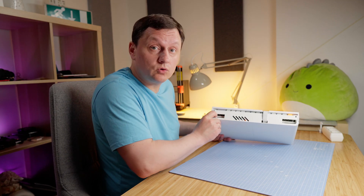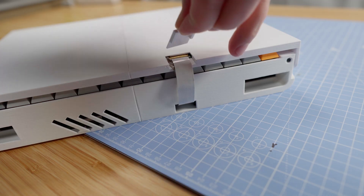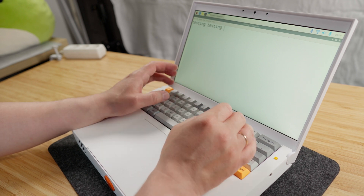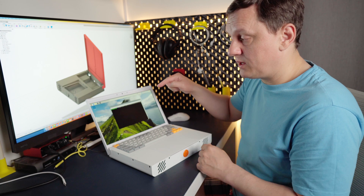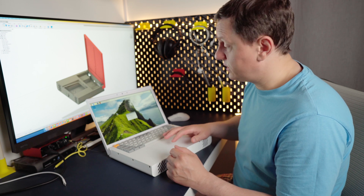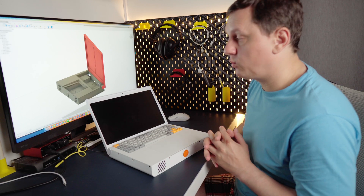If I need to force power off the power banks, I just hold for 10 seconds. I'm printing one more piece to cover the ribbon cable. Trackpad works — two fingers, scroll works. Let's test the power button: Raspberry Pi is running, so it will reboot the laptop. Waiting for boot. Now I'll shut down Raspberry Pi OS. Raspberry Pi goes into sleep mode as well as the screen. Pressing power button wakes up Raspberry Pi, and Raspberry Pi wakes up the screen.